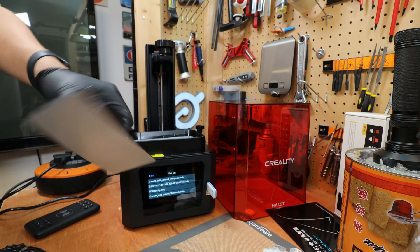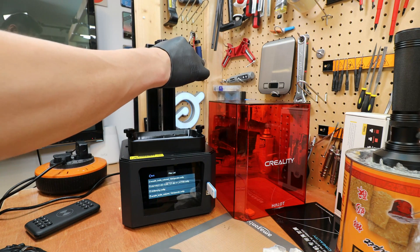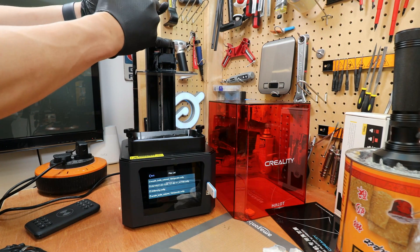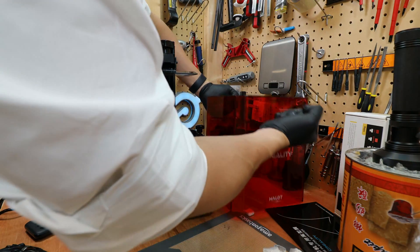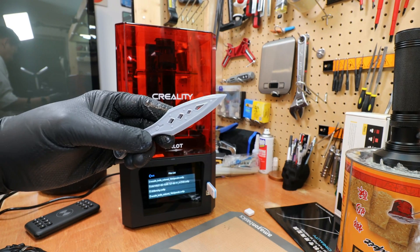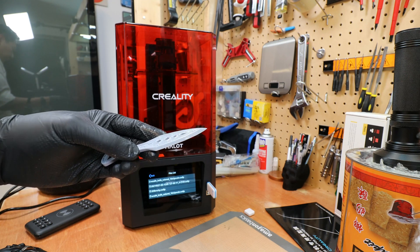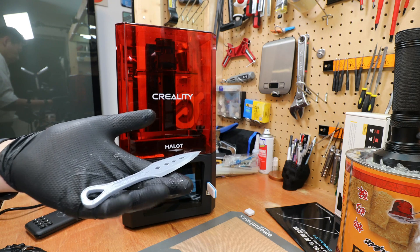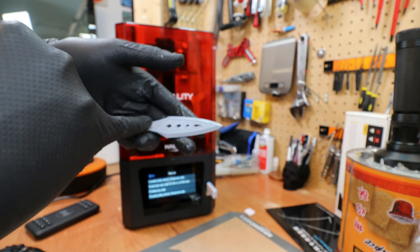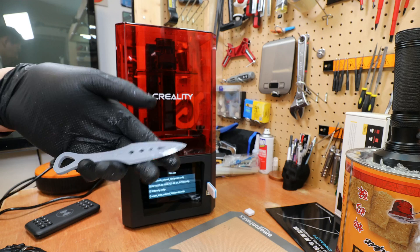The plate is smooth. They do recommend you filter the resin, but as a true newbie I'm not going to do anything to it. I'll just push the plate back, tighten it, put the lid back on and start printing again. At this stage you should use some kind of alcohol to rinse off the excess resin, and then use a UV light or leave it outside so the UV will harden the resin. The edges are perfectly formed — and that's the power of a resin printer.